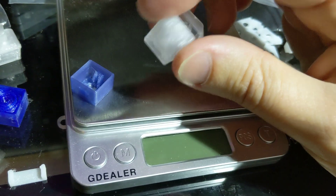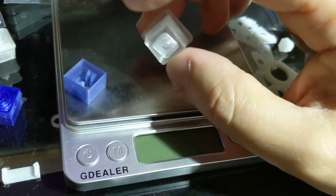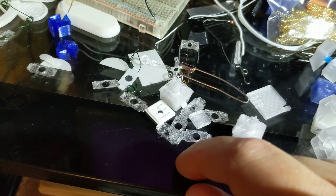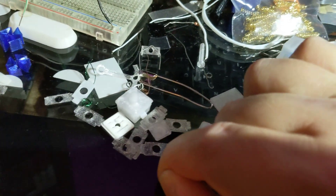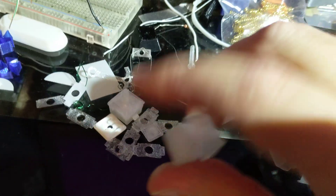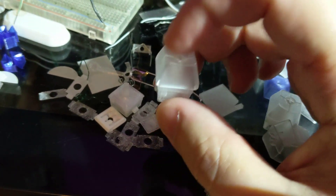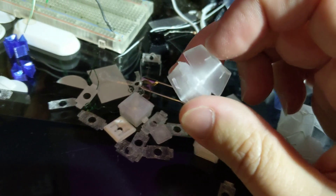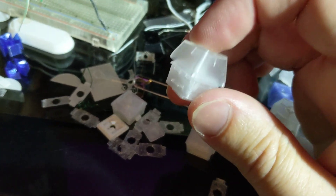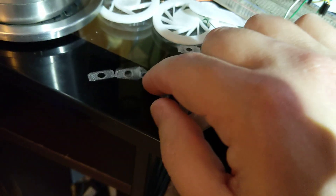For reference, this beam spring — what finally did it — I printed so many prototypes. I've thrown away dozens and dozens of them. You can see them all in different widths and lengths and thicknesses. Most of these are 0.2 millimeters. I did a few that were 0.4, but they were way too hard. And a 0.3. Then I did a 0.1 — that was just too skinny and also unreliable to print at such a small first layer height. This one is 0.15 millimeters, and all of these over here are 0.15 millimeters.